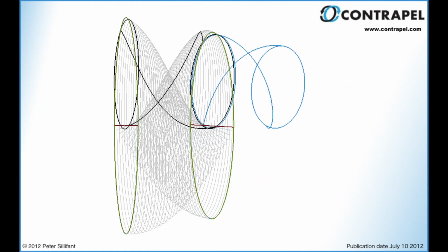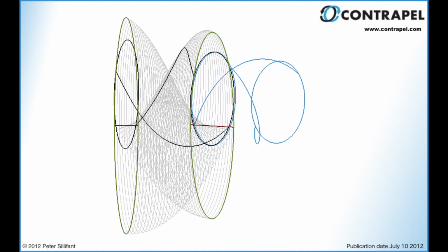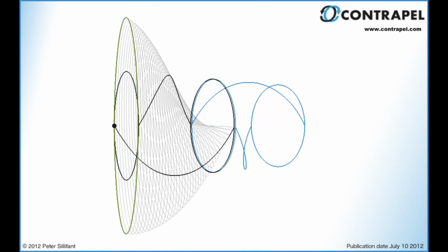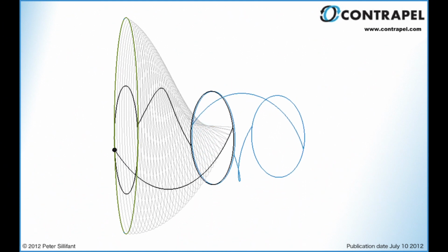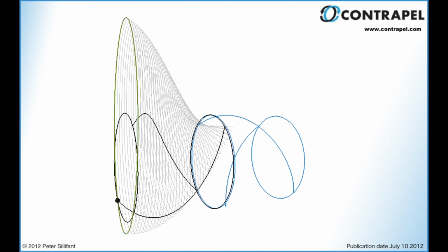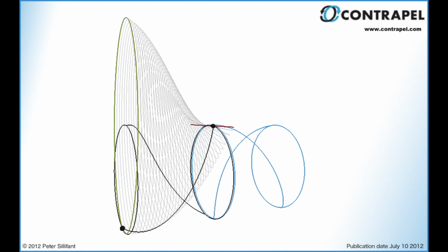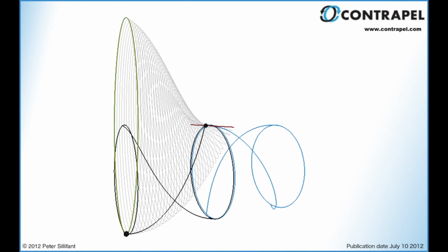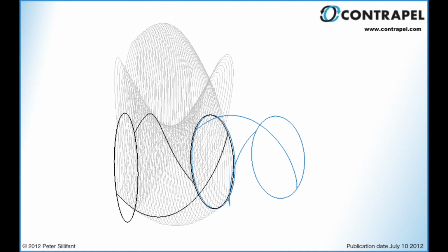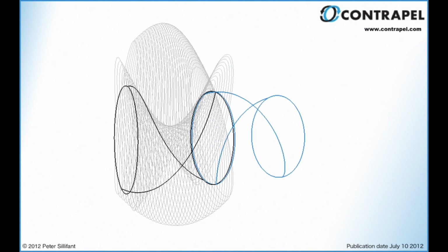The reason for this transition results from the particular point on the compass a given point on the blade starts in relation to the oscillation. In the case of the extreme elongated path, the direction of the vertical component of the propeller rotation is always the same as that of the oscillation. In the case of the flattened path, the direction of the vertical component of the propeller rotation practically always opposes and cancels out that of the oscillation. Adjacent blades behave in a similar fashion except that they are altered in phase according to the relationship between the blade's compass start points and the oscillation.